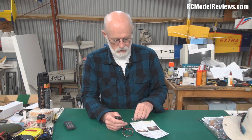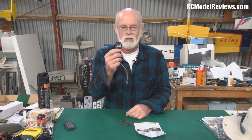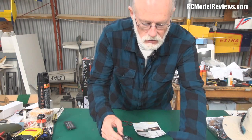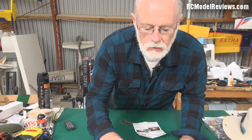Now it's not that full-featured, and it's a tiny little - it's actually quite funny. We've got this tiny little lightweight on-screen display unit, and this hulking great GPS. Compared to some of the other GPS units on the market, this is really heavy and it's big, but it's cheap. An AXN will fly happily with this, so I wouldn't worry too much about the fact that it weighs - that GPS weighs about 20-something grams, which is quite heavy really for a GPS, because some of the lighter ones are just around 10 grams or so.